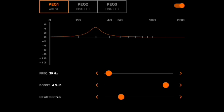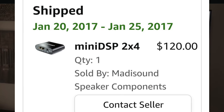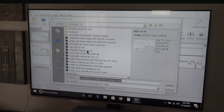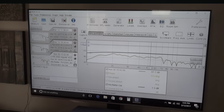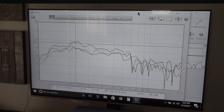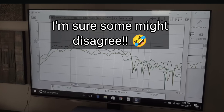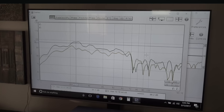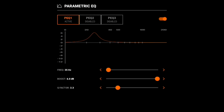Here's the thing that gets really underappreciated about the SVS app. I've used the mini DSP 2x4 before, and you have to use a computer. You have to put it in between your AVR and the subwoofers. You have to run room correction with that installed so it can account for the delay, and you have to have everything disabled so it doesn't affect room correction, then go back in and change it. There's all these pitfalls. The ability to just go in the SVS app, pick a frequency, boost it, and adjust the Q — which is how narrow or wide the adjustment is — is so much easier than the mini DSP.